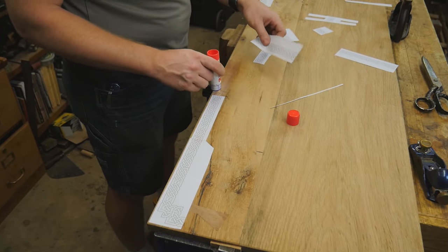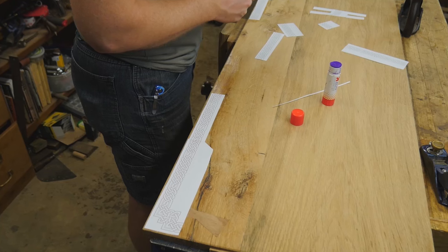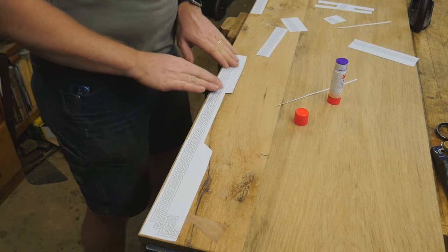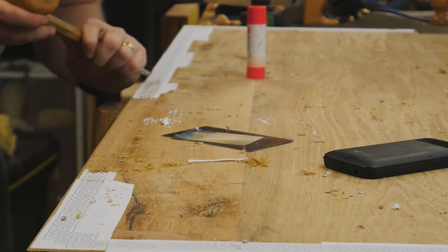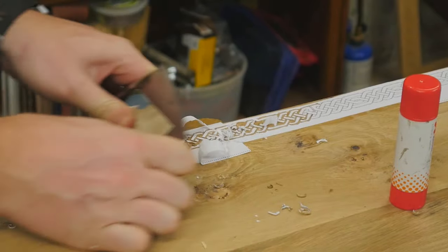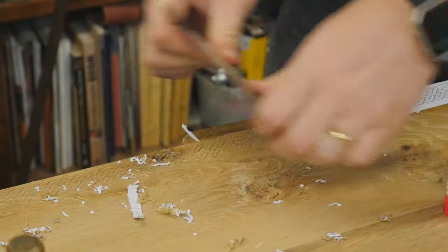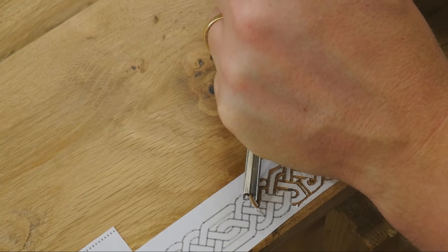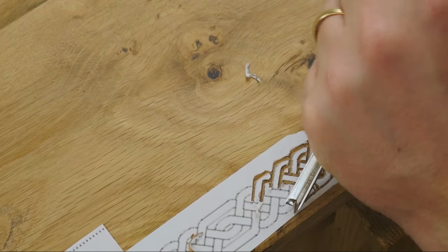Now for the fun part — this is where the carving comes in. I get to express a little bit and have some fun. I found this pattern online and I really love it. I printed it out in a bunch of different sizes and stitched it together so it'll go along the front and the two sides. With some glue stick I can apply it down to the wood and get it to fit from one end to the other. Then I come in and start carving, using a very small V-gouge — I'll leave a link to that in the description below. I follow along the lines making the Celtic weave pattern. To take the pattern off I'm using a card scraper, which works really well since I'm going to be scraping the surface afterwards anyway, so I can remove the printing very quickly. Here you can see how I'm just following along each of the lines very slowly and carefully, making sure I don't shoot over the end and do anything outrageously stupid.